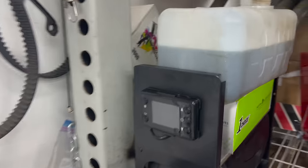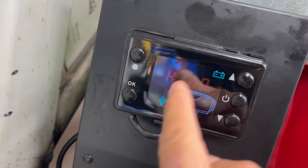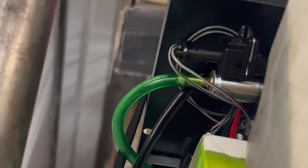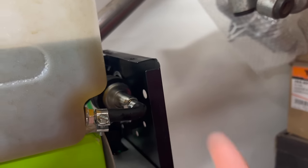I'm calling it — don't run waste oil in your heater. Don't do it straight. Maybe if you're just adding a little bit it was running alright for a while, but running 100% unfiltered waste oil? No — the answer is don't do it. I finally got this thing into prime mode. I also figured out there was plastic on the unit that I didn't notice for the whole video — my bad. It's not priming though, just letting air flow. I think it's not closing all the way internally, so it's just letting air in.